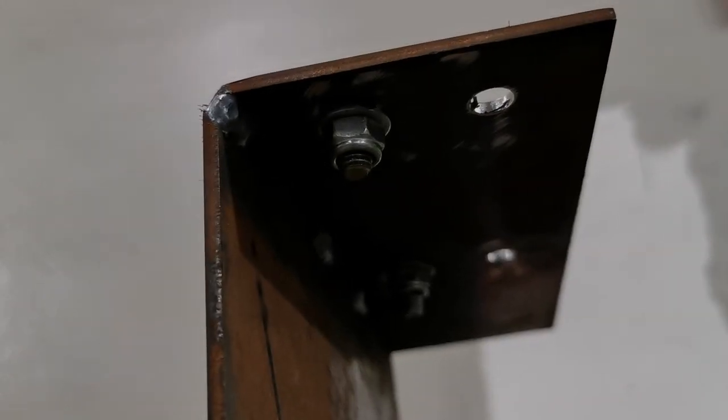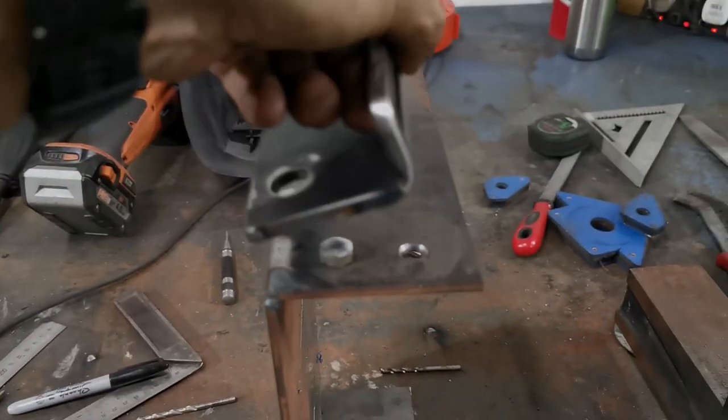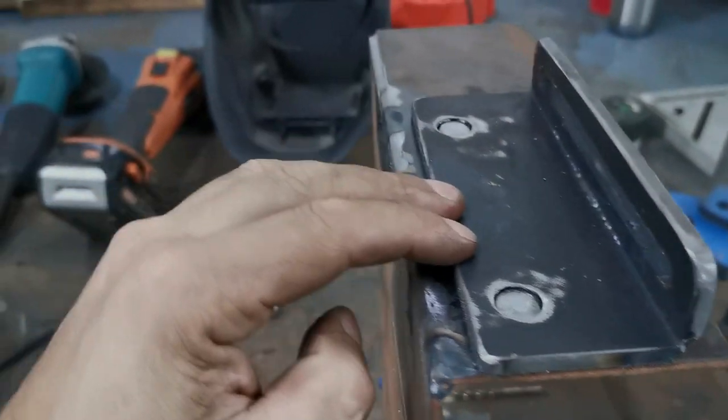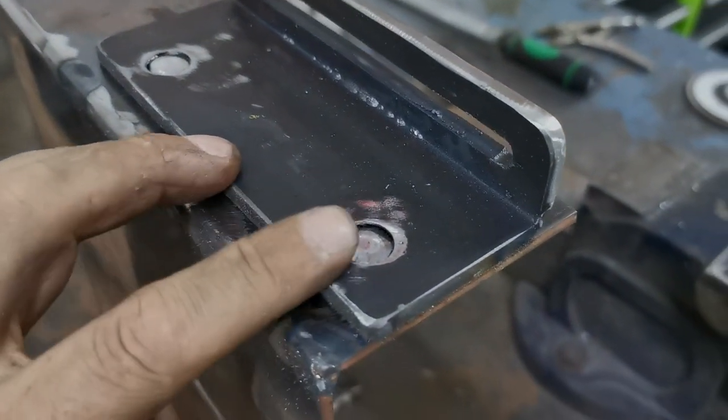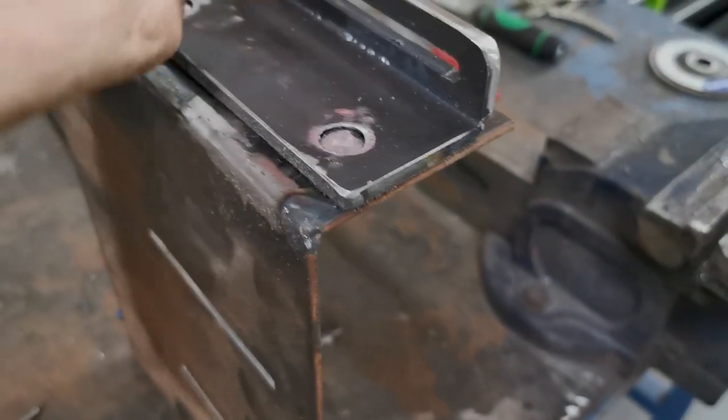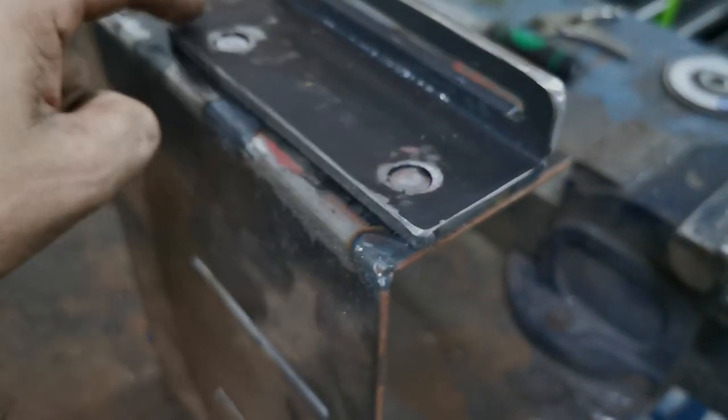So on the bottom, I've just nipped them up, nice and tight, a little washer on the back. And then all I do then is drop the plate on the top, and you can see the back of the bolt heads there. So clamp the plate down now, and then we're just going to hose a load of weld in the back